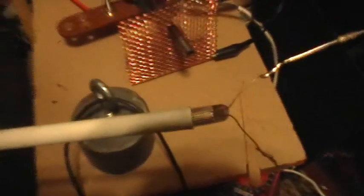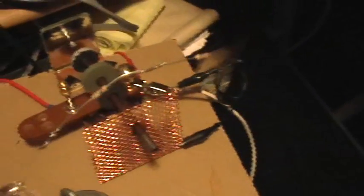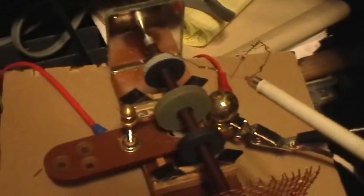Proof of voltage. This is a NE2 with some 10 megaohm resistors. Actually, one of them is a 6.8 meg. So we have about 10, 20, 30, almost 40 megaohms of resistance there, plus a NE2. And I'm just going to dangle that over to the electrodes of the running motor.